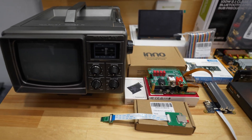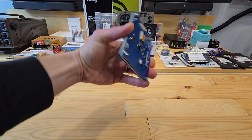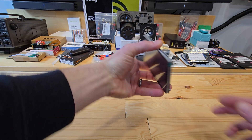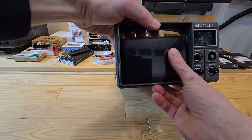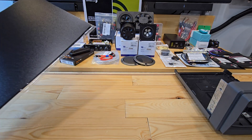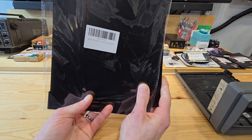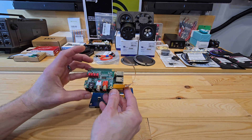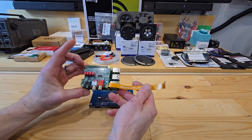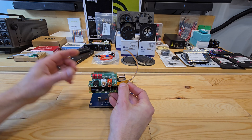I couldn't retrofit a retro TV without a screen. I've chosen this 5-inch screen made by iPissedBit. Despite the name, I'm not pissed a bit. It has a resolution of 800x480 and sits nicely in the front cutout of this Bentley TV. I'll be printing a 3D bezel for it, but if you don't have one available, you could also use cuttable PVC sheets. I plan on mounting my 5th generation Raspberry Pi directly behind the screen, but I've installed this extended DSI cable to give me some flexibility.